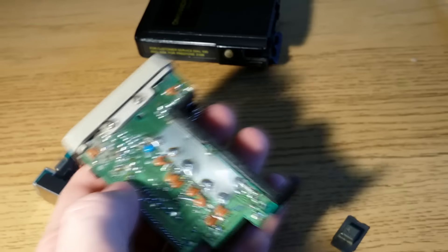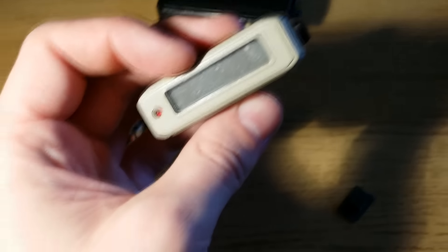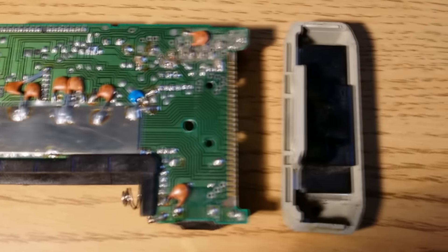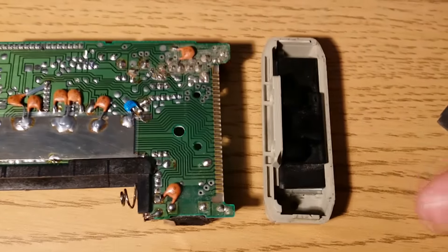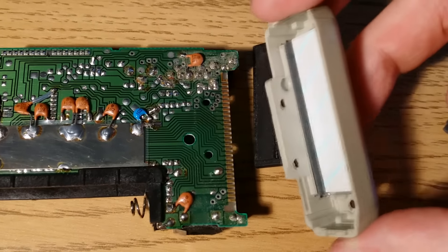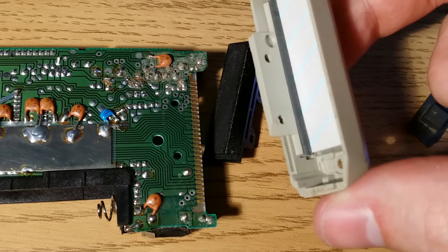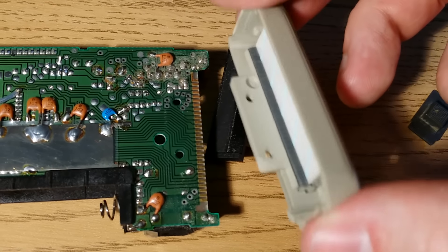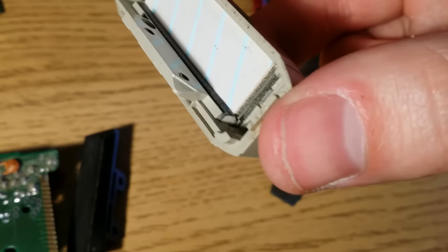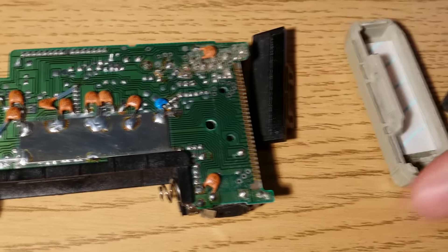It's a rather interesting bit of kit for how old it is. I'm going to take these screws off and show you what the LCD looks like. Now that I've taken the front panel off, as you can see we've got these small gold connections which go down onto the LCD in a compression fit. If I just pop this out — the LCD is mounted in there with a small rubber compression connector at the bottom. It's quite unusual because most of these displays are a horizontal mount, but this one's got a vertical connector instead. It looks like they custom designed this little bit of plastic with a small right angle connector that goes over to the LCD module, held in with the two screws I just removed.